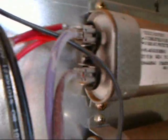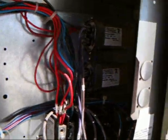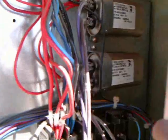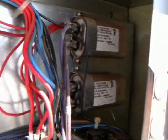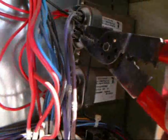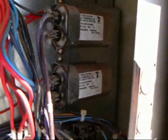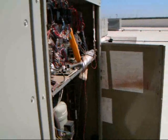Basically, maybe I'll show in a little schematic - those capacitors are discharged through the motor run windings. The only way you'll ever find a run capacitor with voltage left in it is if a wire or a winding burnt up while the unit was running, basically disconnecting one of the leads while it's running, and there's going to be some voltage in there. The voltage charges and discharges 60 times a second, so whenever it's just connected, whatever voltage is in there will be just random.